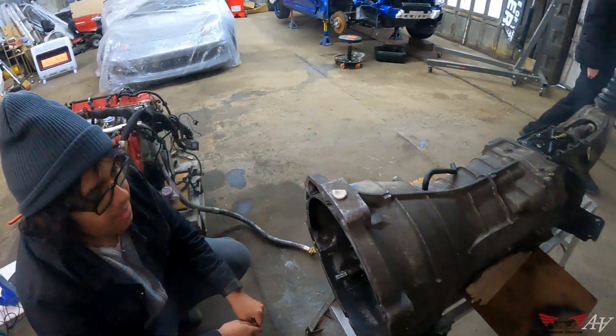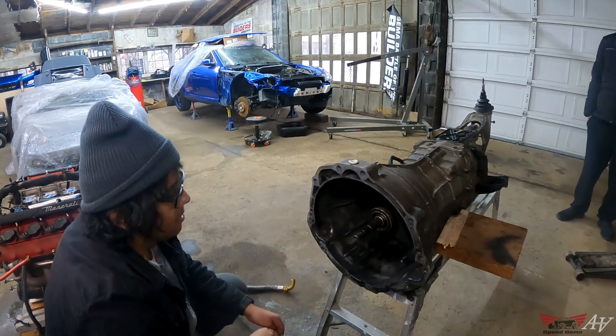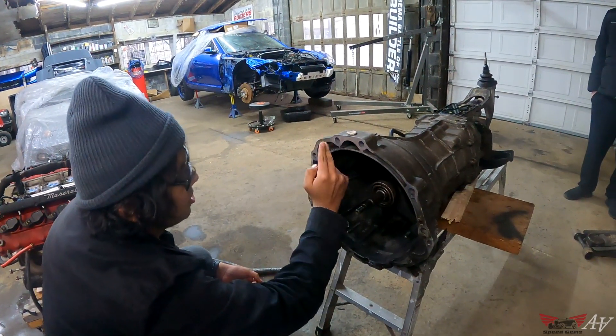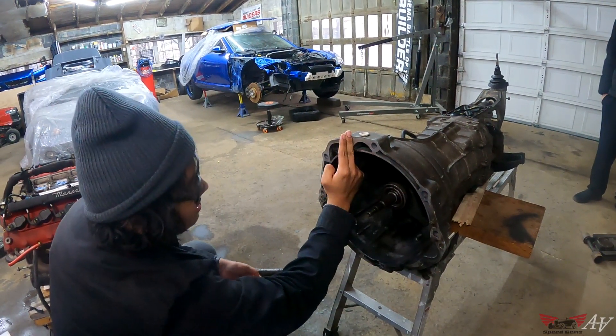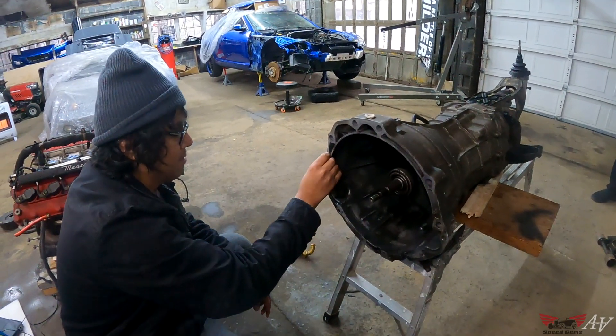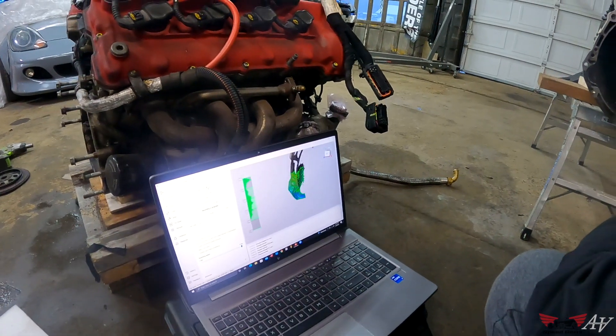This bell housing is a little bit bigger than what the scanner would ideally handle. Although you can scan almost anything, it can uncalibrate itself because of the way it works — if you start straight center and move away it will be off just a hair, but not enough to notice on the whole part. So I'll put these markers down so it can reorient itself.